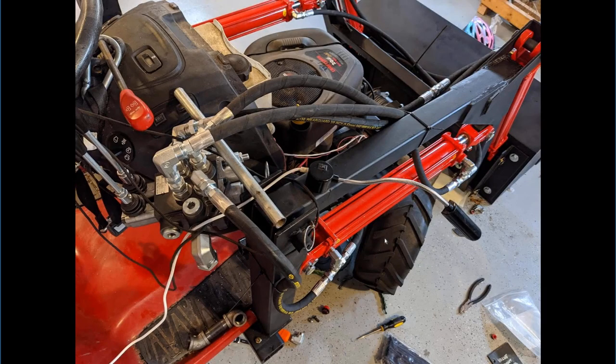Here you can see me trying to put together a lot of the hydraulic lines. I didn't know what I was doing — this is my first project involving hydraulics. The hydraulic valve does not come with any instructions. What I learned is there's a 'goes-in-ta' and a 'goes-outa,' and for each joystick there are two directions — no different than a faucet with hot and cold. High pressure comes in, and the return goes back to the tank — there should be a marking on the valve that says T for tank. The bottom side of the cylinders will make the boom go up; it tees off and goes to both sides, and those hoses have to be routed the right way.